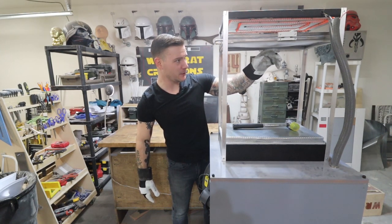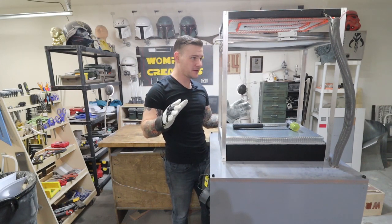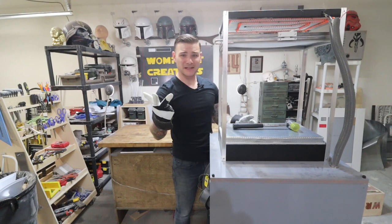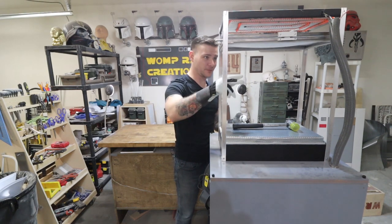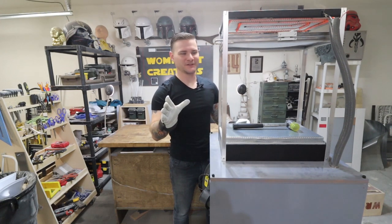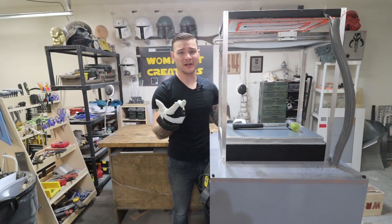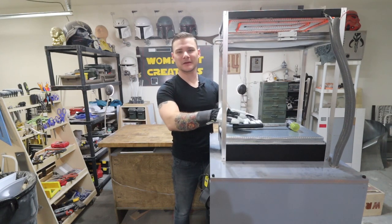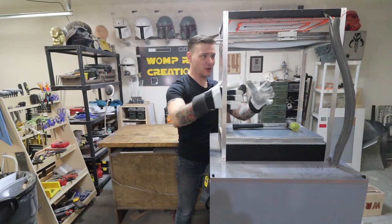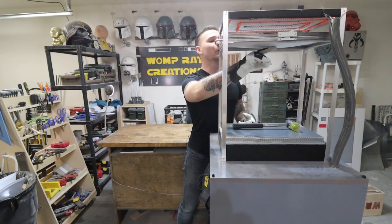I want to let it heat up a little bit more. A lot of this is kind of a feeling out process. Everything kind of depends on your heater, your distance from your heater, the thickness of the plastic you're using, the type of plastic you're using. There's a lot of variables that can go into this. And whatever you're forming, the thing that you form is commonly referred to as a buck. Whatever your buck is, if it's really tall or really wide or whatever it is, it might take a couple times to make sure that everything is working well.